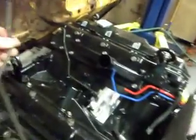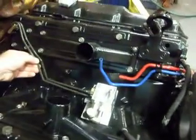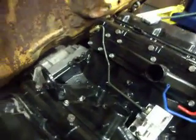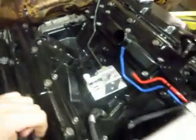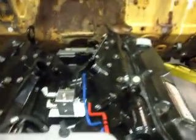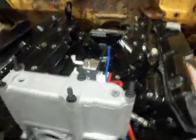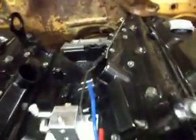Let's bring it over to the engine. I finished one up a little bit earlier, already got it in there with the fittings on the ends. You can see just that quickly I've bent this one up — it's a perfect match, perfect fit every single time from the fitting at the very back of the head to the fuel block up at the front. Once you figure it out one time, there's no guesswork anymore.